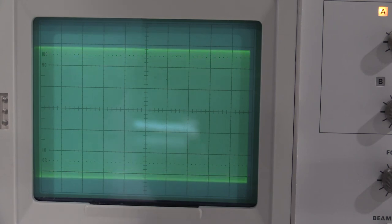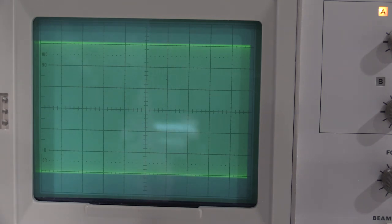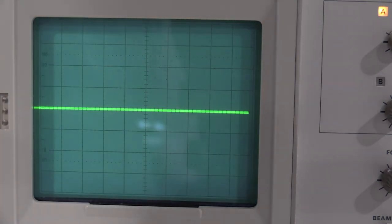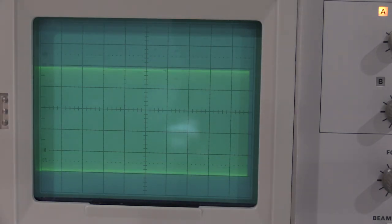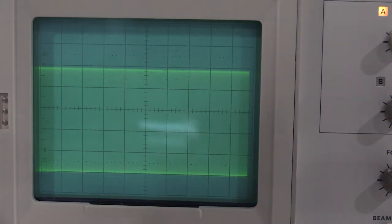Now I'm a little low on my amplitude. I'm doing this through the screen on the camera, so I didn't get the right traces. That didn't make sense given how the high frequency tuning was for it not to work. So get down here again. 1, 2, 3, 4, 5, 6. Okay, 6 divisions. Test this again real quick. Yeah, 4.8, so I didn't have the test set up right, so that is fine.